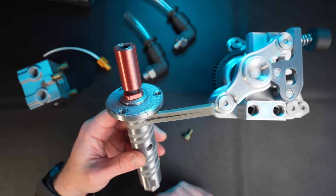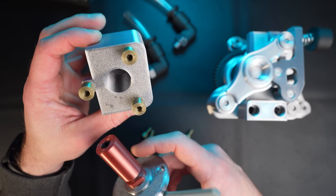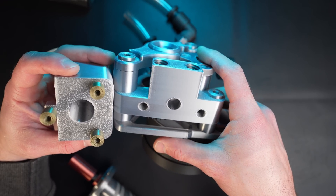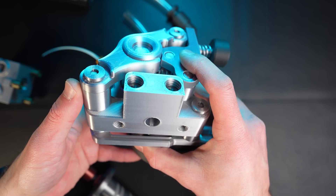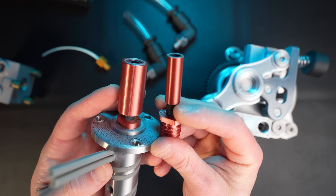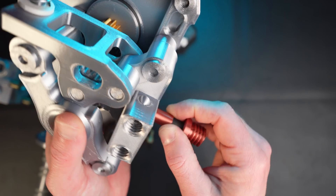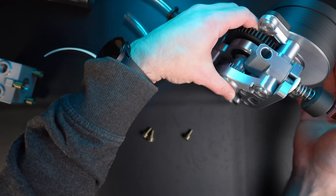What we're gonna do — since this heat break is the one that goes inside that normal heat sink and that hole is seven millimeters wide, on the VZ extruder we have a four millimeter wide. That is because the normal configuration uses a bowden tube. So what we're doing right now is we have made a new heat break, so as you can see it's smaller, and now it can fit inside that extruder.